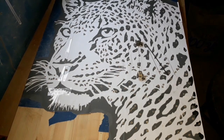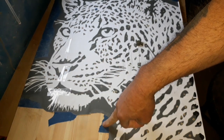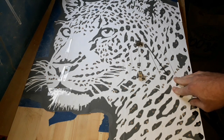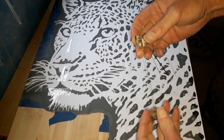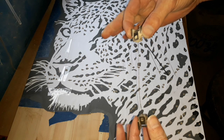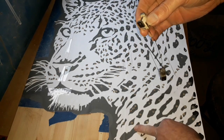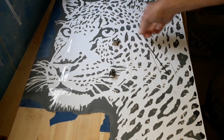Right, you can see from that, we sanded down our wood, we put on our painter's tape, we glued down the template, we've drilled our pilot holes, over 200 of those roughly. I'm going to have to change these adapter clamps on mine, because my scroll saw is so old, that's the only way I can use pinless blades, and that will hook underneath the clamp at the bottom and hook over the top once we've threaded it through one of these pilot holes. So I will have to do that over 200 times.